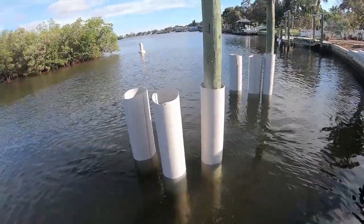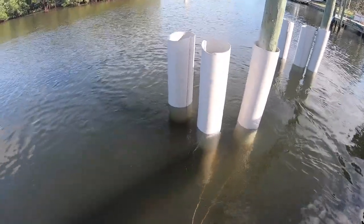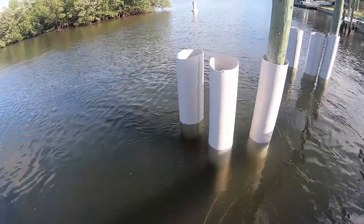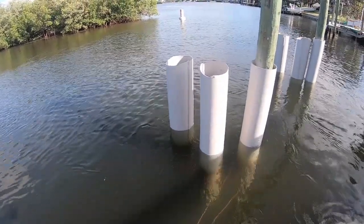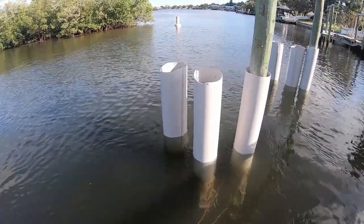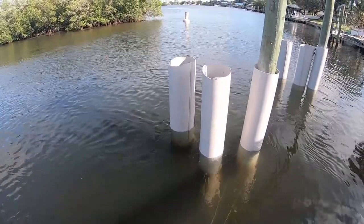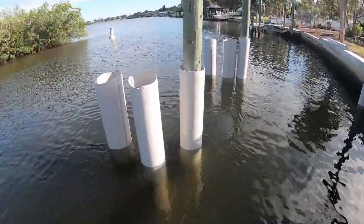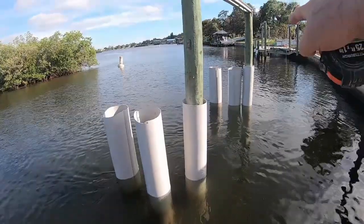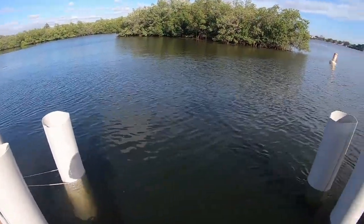But these, the rafters for the deck will actually be sitting on top of these now. So I need to cut those so that they're flush to the height that I want, and then add my rafter at 7.5 inches and my decking at 1 inch, and then that will be all the same height as the seawall all the way. So I've got to mark those out there, mark these here, and mark these two over here.